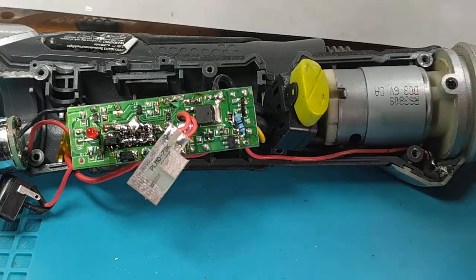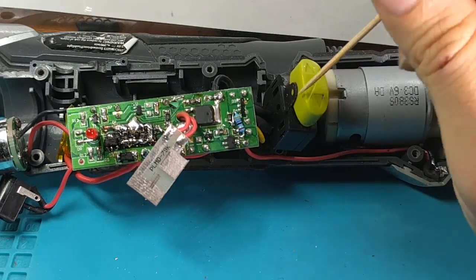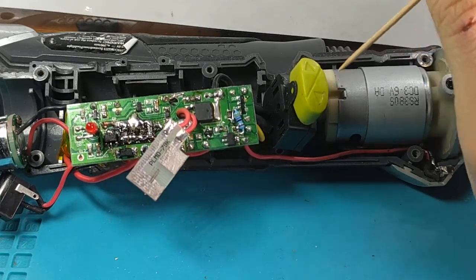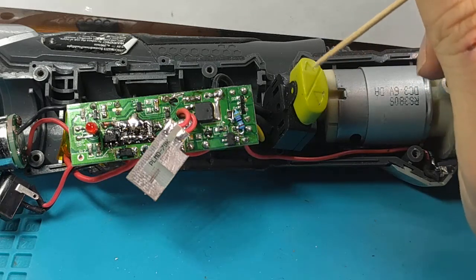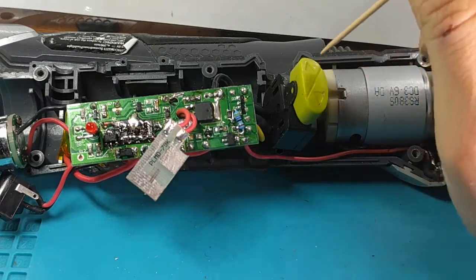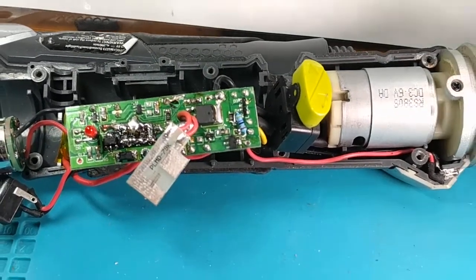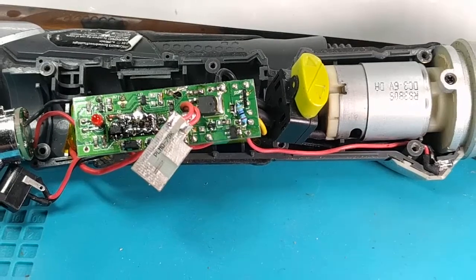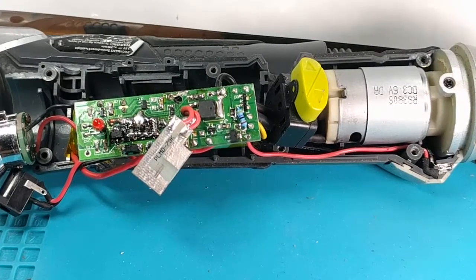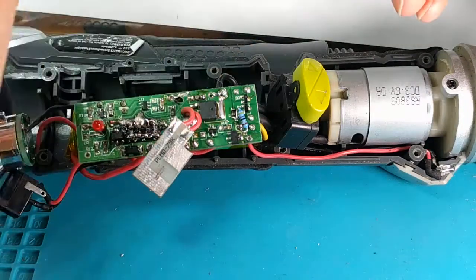To drive a motor in reverse, you have to reverse the polarity. How they do that is actually internal in this button — it swaps the polarity. It's kind of an advanced button, so hopefully it never breaks, because this is the one thing that really isn't replaceable. One other option for doing that digitally would be an H-bridge — a configuration of MOSFETs that lets you switch things in reverse. And you can get pretty cheap controllers now that have built-in H-bridges in a single chip, popular for drones and Arduinos.